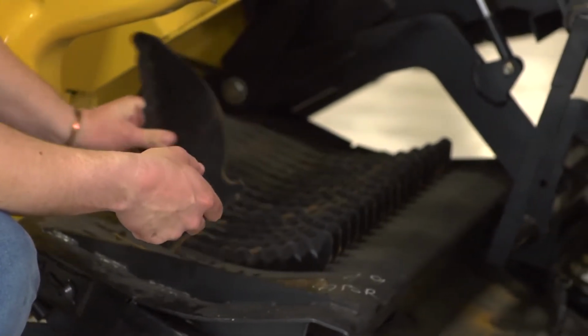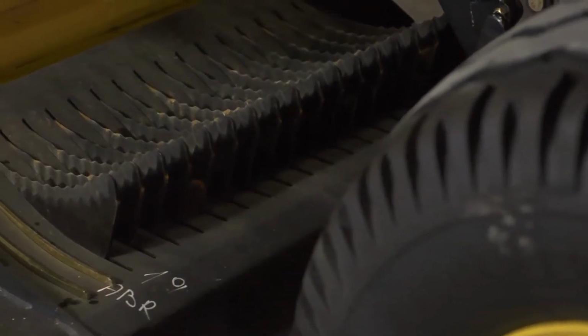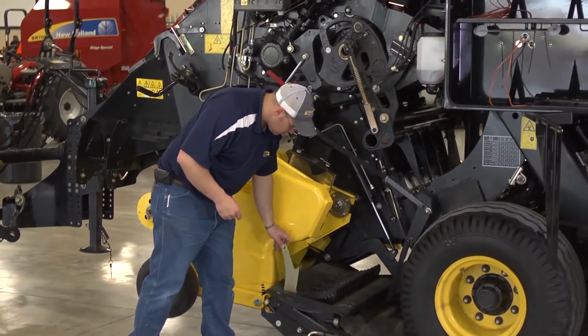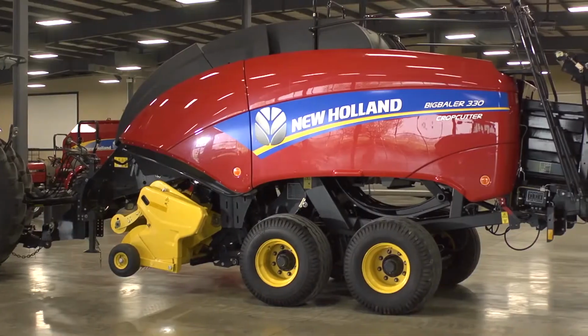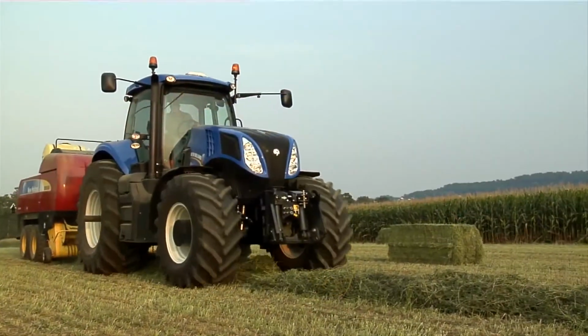If you need a longer cut crop, remove knives from the knife drawer to accommodate your desired cut length. Replace the knives you removed with blanking plates to keep the knife beds clean. The blanks are stored conveniently on the side of the baler for easy access. Replace all safety shields and locks before operation.